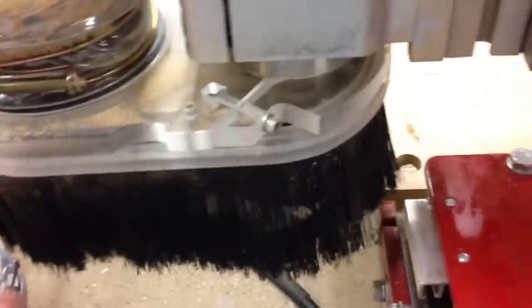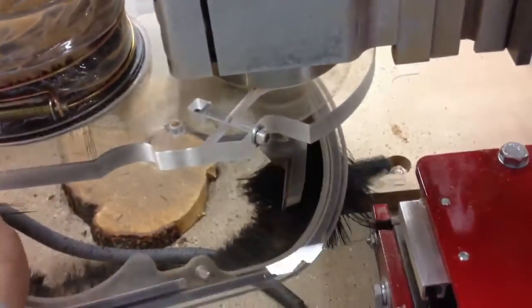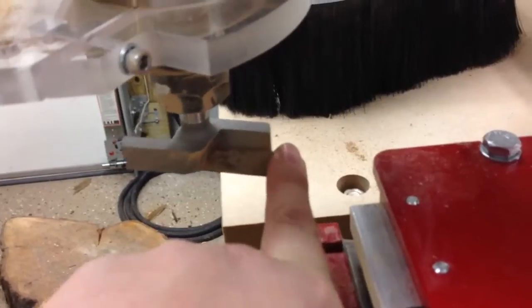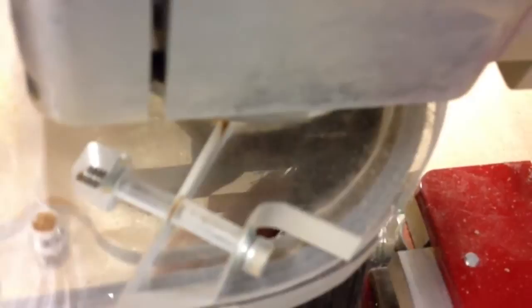There was one big disappointment today, and that would be the dust shoe from Kent CNC. I don't know if you remember from an earlier video — I was concerned about the fact that there wasn't very much distance between the back of the shoe and the edge of a planing bit. That turned out to be a very valid concern. Even without suction, you can see it just barely touches the bristles here.